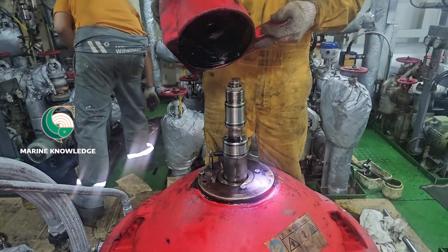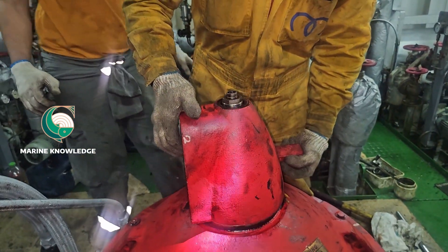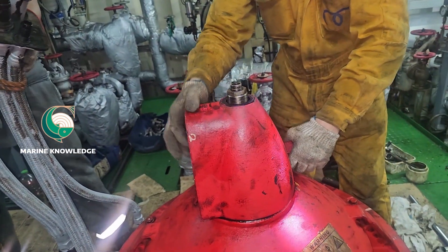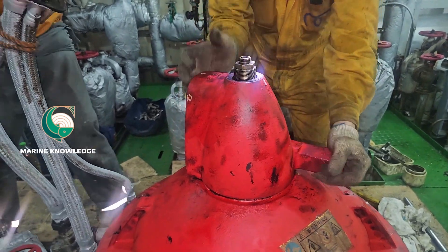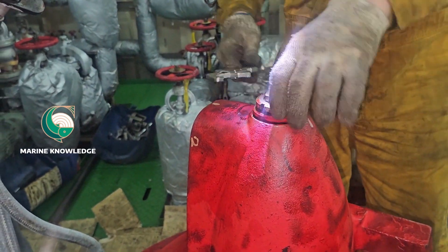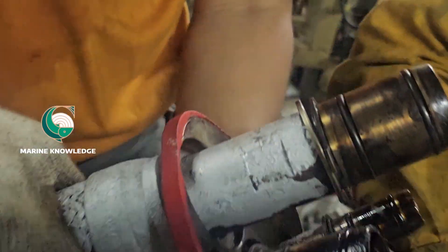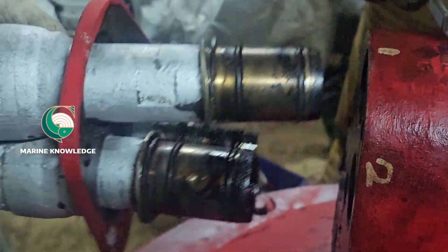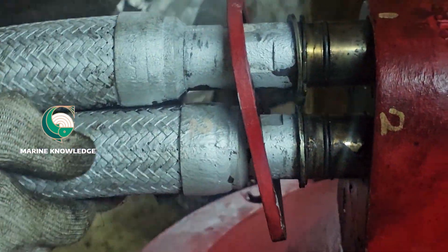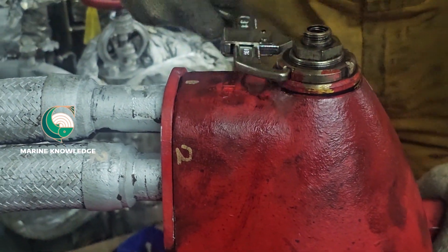Check the spring action and movement of the spring. Then put back the housing assembly — this is the connection housing. Fit it back and give it a light tap; it will seat in place. Put back the lock nut and washer, then reconnect the pipe connections. We have O-rings for the inlet/outlet pipes — if you find the O-rings are damaged, renew them.